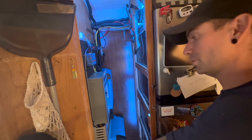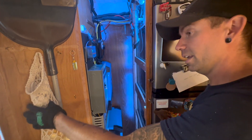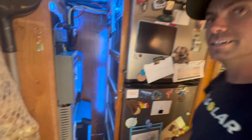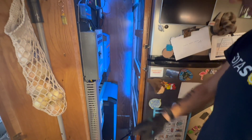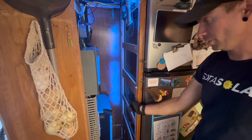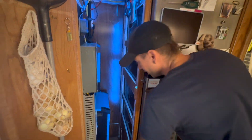I measured it and I thought I subtracted the three inches for the raceway off of my measurements. We planned it and built it in the shop assuming there would be a three inch raceway going not on the board but next to the board. After a long and very strenuous time getting this in here, as we're fitting it in, I realized it's not the size I anticipated — but it did fit perfect. I just had to redo some stuff, cut a notch, reroute a lot of wires. I had to redo almost everything except actually mounting the RS450 and the Multi Plus 10,000.